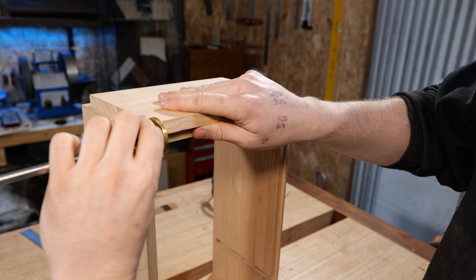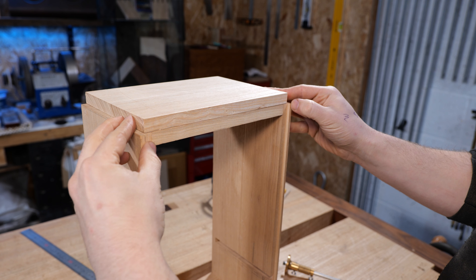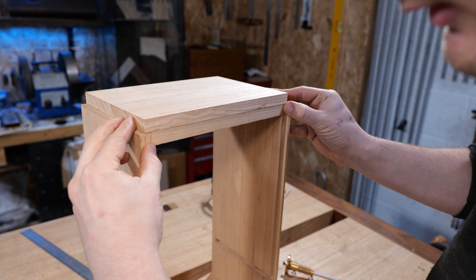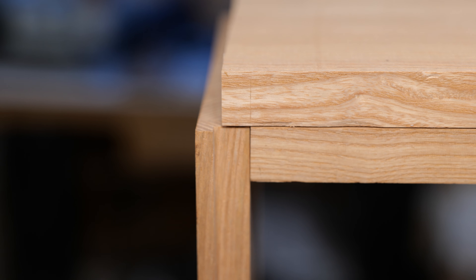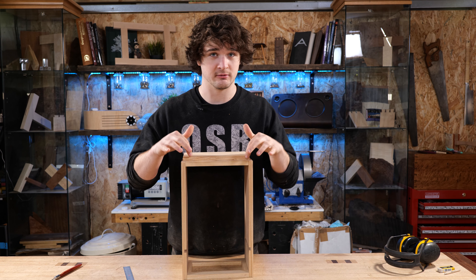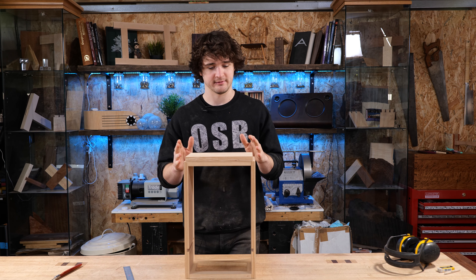What we can do instead is set the gauge to the desired dimension — in this case eight millimeters because that's how deep we cut the groove — and scratch it on the back of the shelf as a tester. We're just going to line those marks up with the shoulder lines on the dovetails. It seems I was lucky or super cautious when sizing the material — you can see the line scratched on the top there lines up directly with the dovetail shoulder line on both sides. Be sure to check that those shoulder lines align with the dovetail shoulder lines before cutting anything out.